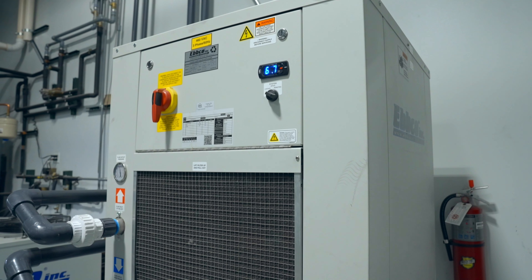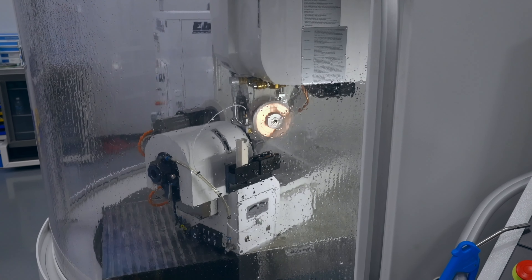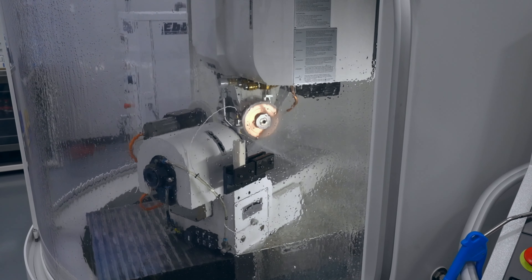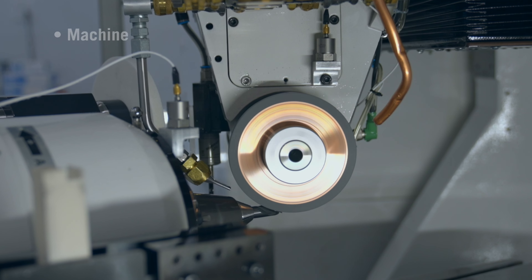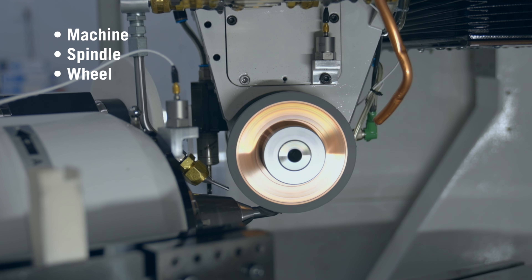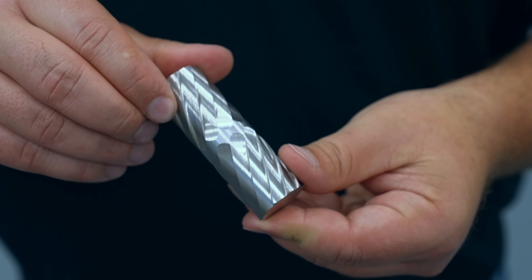Finally, let's talk about temperature. It's absolutely critical to remove heat during the grind. If you don't have a chiller on your cooling system, the oil gets hotter and hotter as you grind. After hours of use, you're essentially using hot oil to try and remove heat from the grind zone, and that doesn't work well. The point of a cooling system is to stabilize the temperature of the machine, the spindle, the wheel, and the parts, so you don't get fluctuations in your dimensions — which is especially important in precision grinding.